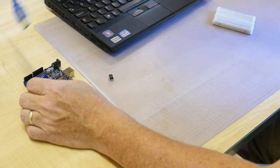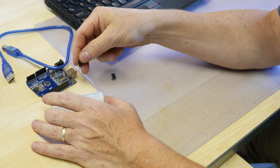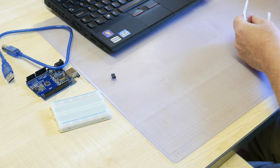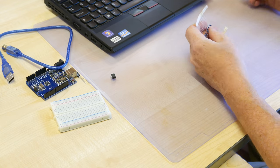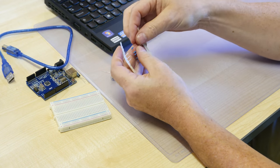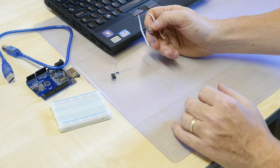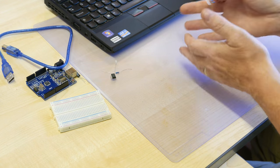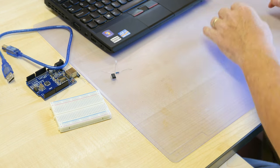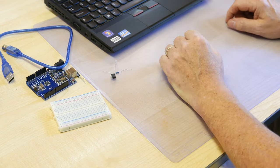I'll use just basic stuff that most people will have in the Arduino environment: an Arduino UNO, a USB cable, a breadboard. We'll use the UNO as an ISP. We're going to need a 10 microfarad capacitor to disable the reset button when it loads through to the ATtiny85. It's also useful to have an LED with a resistor — when you're debugging, a blip to the LED tells you the code is in fact running. You'll need some DuPont cables as well.